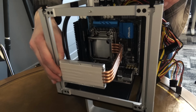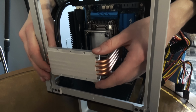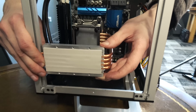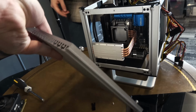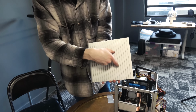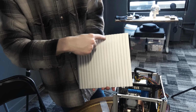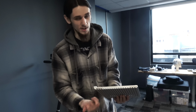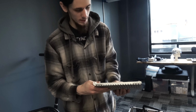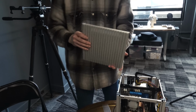So it's very difficult to do this the correct way, and the correct way is to put the heatsink this way. Yes. And that is so that it will just have more surface area contact with this when you put that on there. So it actually runs thermally, the striping will go across here, so all of these will conduct heat as opposed to vertically where it'll just run a few of these panels, because these are all through-hole heatsink fins. They go all the way through. So however many we can contact on this plate actually will help with our thermal dissipation.